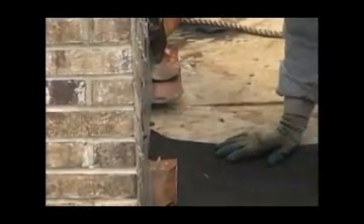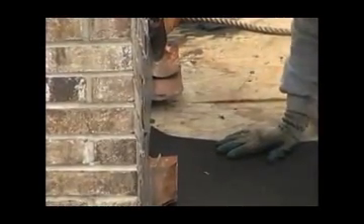GAF Elk has several shingles that are much wider than standard shingles, measuring 17 inches wide by 40 inches long. The non-exposed area on these shingles is typically 9.5 inches wide. To completely cover these shingles with step flashing, use 10.5-inch wide flashing, or simply install two pieces of normal step flashing to fully cover this area.